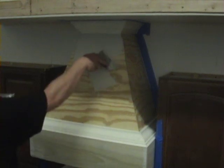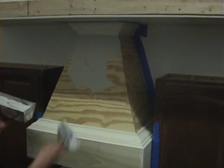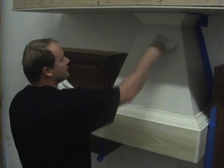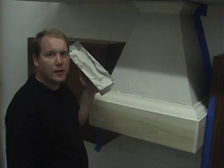As we put our drywall mud on there, sometimes it's great to remember that messy sometimes is neat. That's what's going to make this look so unique and so different. One tip when trying to get the desired effect is to make soft strokes at crossing angles, and that'll help give you a look that you'll probably end up liking.